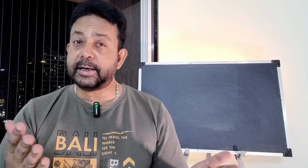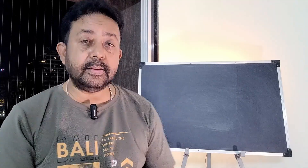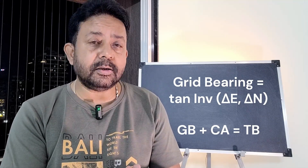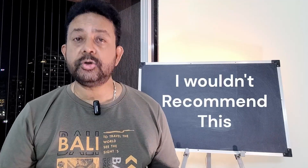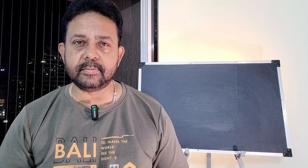Another quick way: set up two DGNSS antennas, one at the bow and one at the stern, at the vessel's centerline, and carry out simultaneous observation for at least one hour. Take every minute of position data between the bow and the stern, convert them into grid bearing, apply convergence angle to make it an azimuth, and then compare it with the vessel's gyrocompass. And the last method: if the vessel's sides are straight lines and parallel with the vessel's fore and aft line, you can use tape measurement from the jetty to measure the distance to the vessel's side — and that has to be carried out simultaneously. This is also the same way you can do a gyrocompass calibration for the vessel.